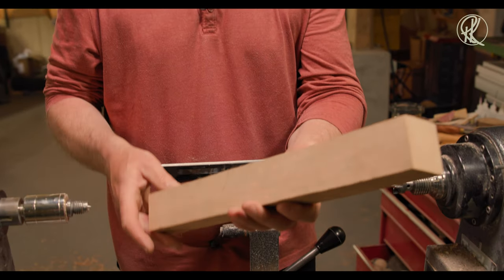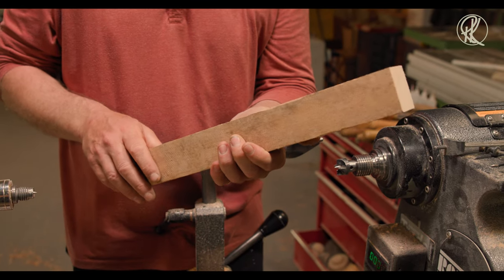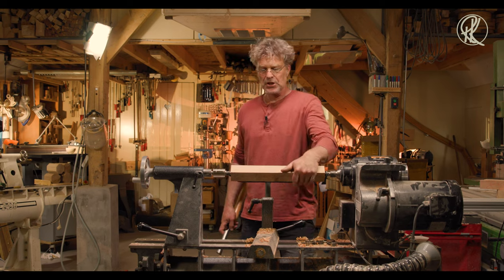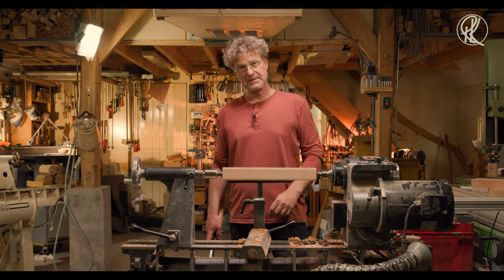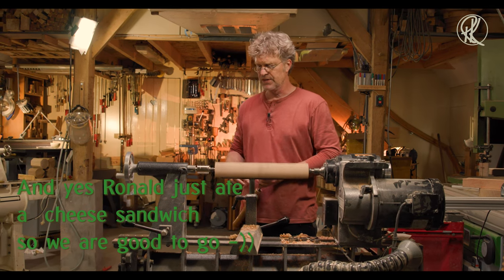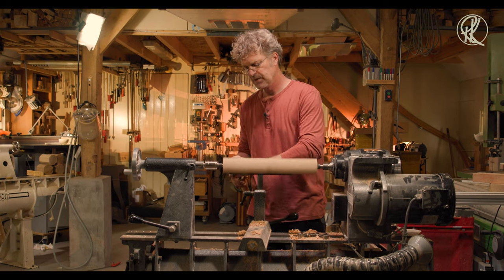If you ask a furniture maker, where do you use beech, he will say, we'll use beech in a piece of furniture or in a construction where it moves. Okay. Beech has to move. So it's pretty much straightforward spindle turning. It's square now and I have to make it round. And we make it a little bit thinner here and a bit thicker over there. There we go.